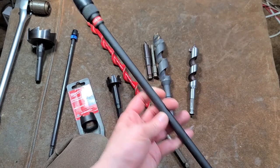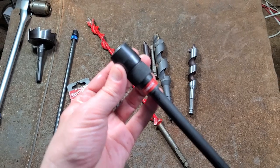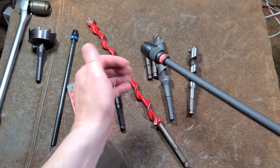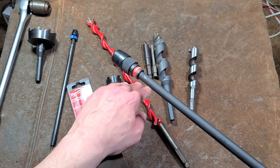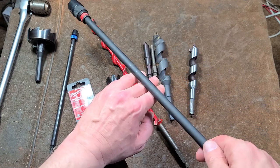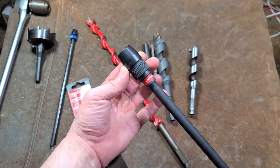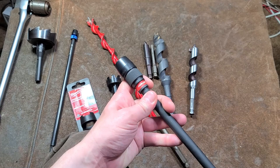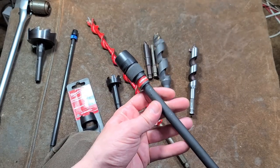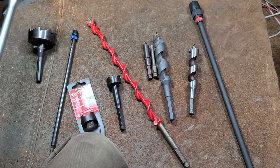Something to mention: it's a 1.1-inch diameter on the head. So the minimum bit size, if you're actually trying to go through a deep cross-section of wood rather than just getting reach around piping or wiring, is going to be one and an eighth inches. Anything smaller than that and this collar will bind and get stuck in the hole.